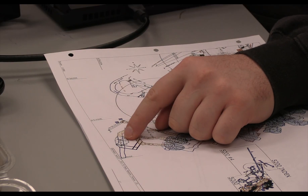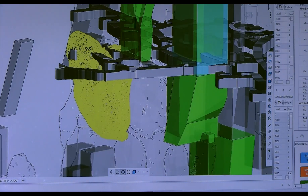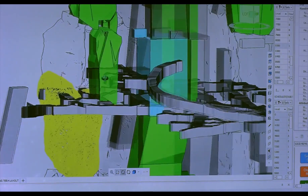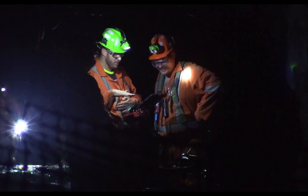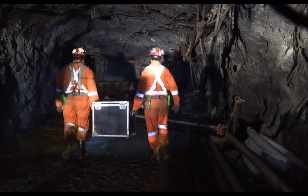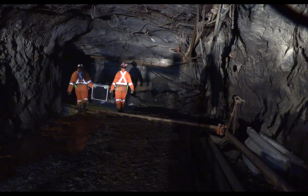Once you've decided on the type of inspection, the blueprint becomes crucial. It provides essential information about the asset's size and geometry, guiding decisions regarding the pilot position, the need for a telescopic pole to place the range extender or other techniques to reach the same goal, the use of a protective vehicle, and the placement of geo-referenced reflective targets before the inspection.